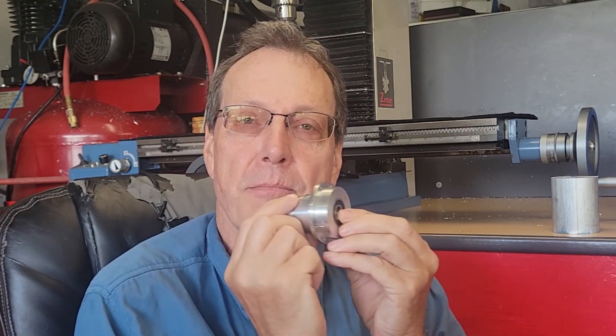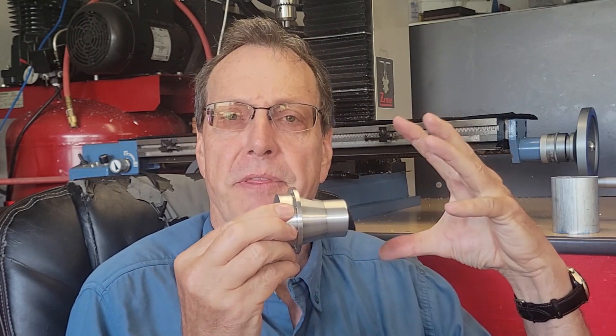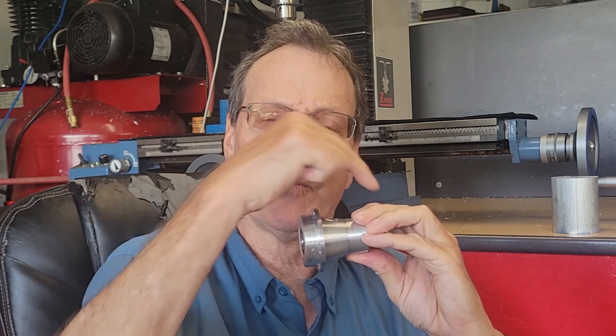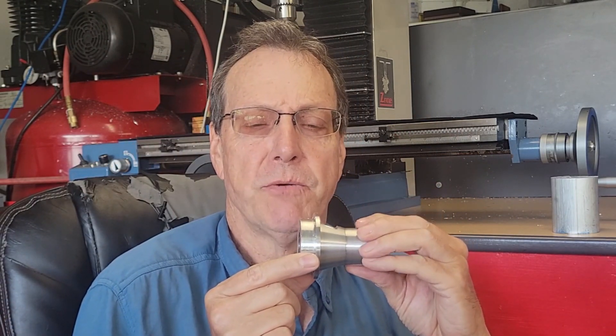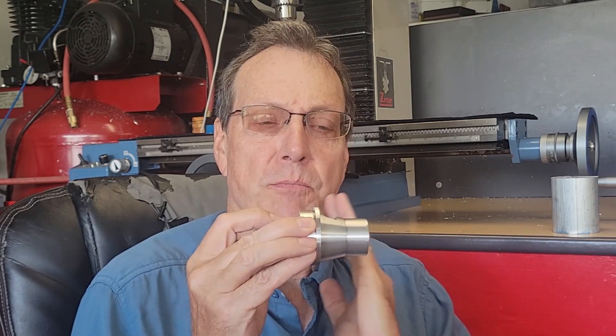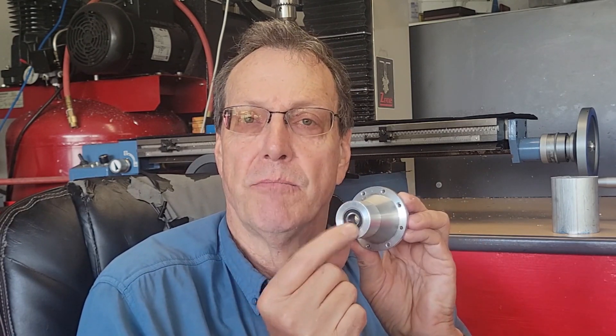Let's pull this off and come up with our machining strategy on the lathe. So this is our crankcase front. We've got a ball bearing in the front and a ball bearing in the rear. The way I machined this, I put this in the lathe and I clamp this side in the chuck and machined this way. We'll machine all of these features here, the taper, and when we're done we'll part it off, turn it around in the lathe face, and bore this last part for the bearing in the front.